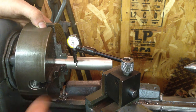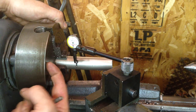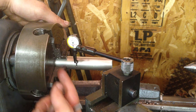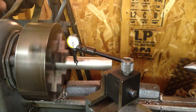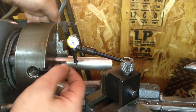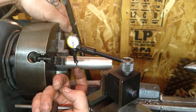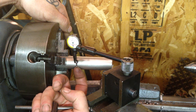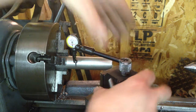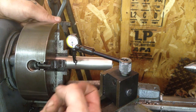I begin by getting the piece in there, eyeballing it, and cranking each jaw individually to try to center it. After that I use the grooves on the face of the chuck and try to get the ends of each jaw to line up with — in this case — the third line. I disengage the belt so I can spin the chuck easily. If you spin it around you can see it's at zero, so it's not even touching the indicator. This indicator has a dial with a little spring and ball — when you put pressure from the backside it moves the dial. It's attached to the lathe by a magnetic base; you hit the button and it doesn't move. It's on the carriage, so I can advance the carriage away from or toward the camera.